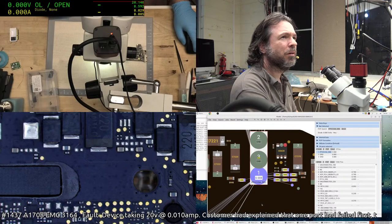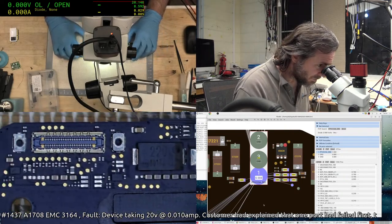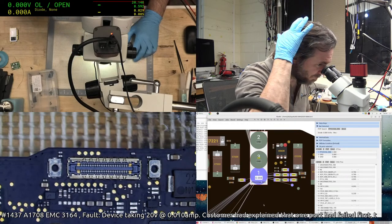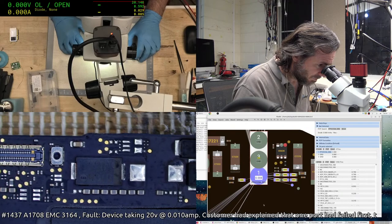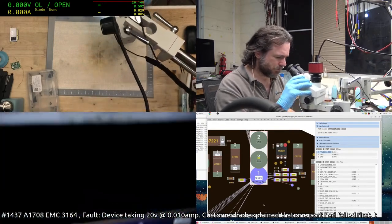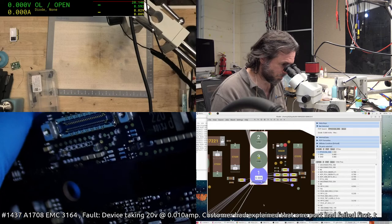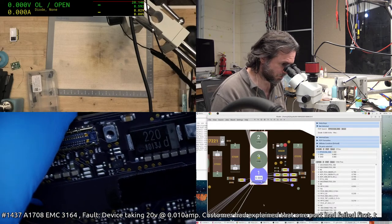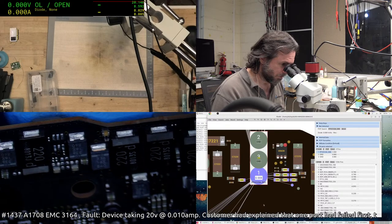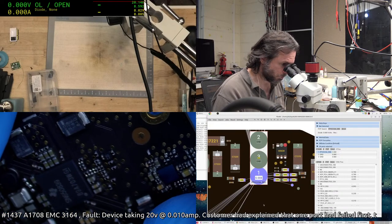Drive had no spin, but the heads were moving. Okay, well, they're lucky then. They're very lucky. No spin. Either the motor drive controller might have died, if they're lucky. Even still, surprised that the heads tried to move though. Unless they were trying to move out of the way. Normally there are fail safes with sensors on those drives so that they don't move the heads until the platter is actually spinning, to ensure there is an air cushion beneath them. I suppose it depends on the model.